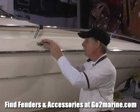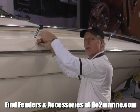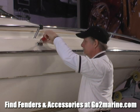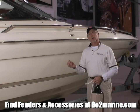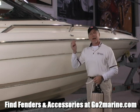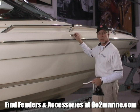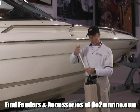Okay, what's left now is to secure the bracket onto the boat with the two number 10 by 1 1/4 screws enclosed with the bracket. Get them snug, but don't over tighten. Okay, included with the bracket is this solid stainless steel cast eye. Now the eye is slotted so that when it drops into the bracket, it goes in one way and can't come back up out.